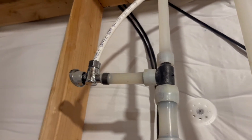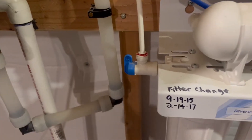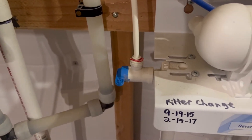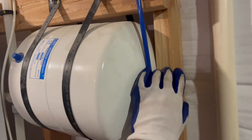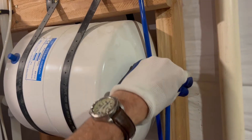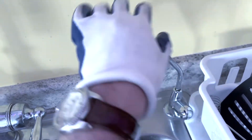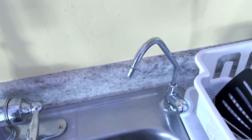When you're ready to get started, locate the shutoff valve for the reverse osmosis system and turn that off. There's another valve on the inlet — I always turn that one off as well. There's also a valve on the tank; if you shut off the one on the tank, you'll keep all the pressure inside so you don't have to drain down the whole tank. Then open the faucet and let the rest of the pressure out.